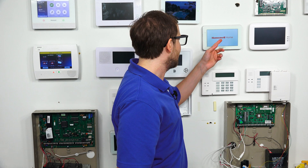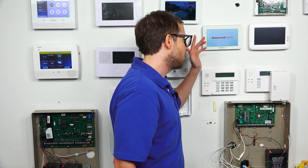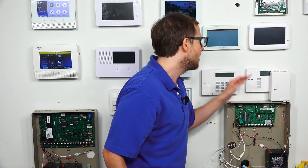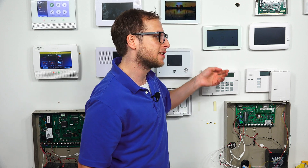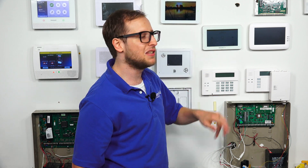As I probably should have pointed out a second ago, you see our keypad was lighting up before I did the battery. So we know we were getting AC power to the system and the system was powering back on. And that is the power cycle — that is how you power cycle your wired system. You have to do the full cycle: power it down and then power back on.